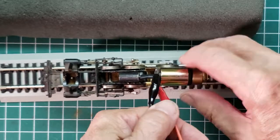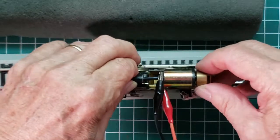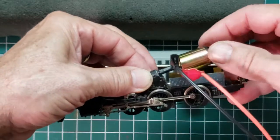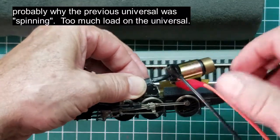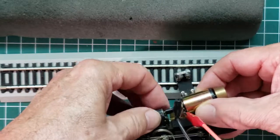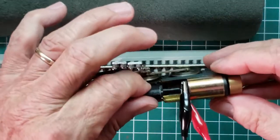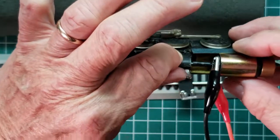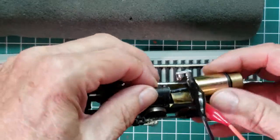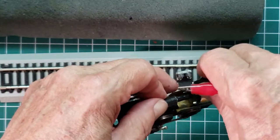Okay. And so there's a stiffening or a tightening or something happening here. The motor's not turning. So it might be something with the gearbox, and I'm doing this by hand here because it looks like there's current flowing in the motor, but it's not turning like it's supposed to. There, it's going a little bit. Now this is going in reverse, so I'm going to go ahead and change the contacts here.